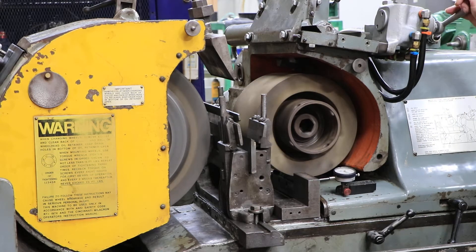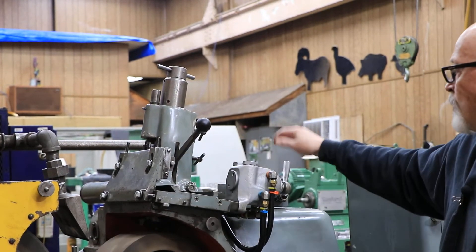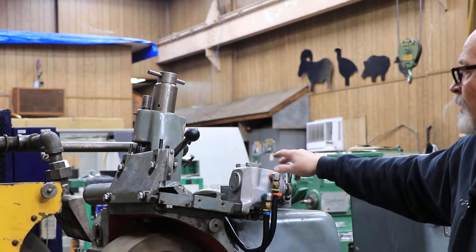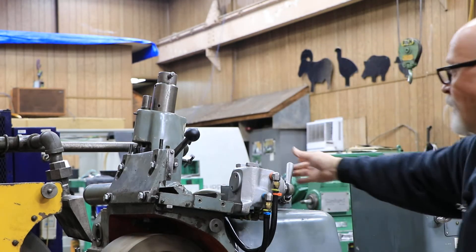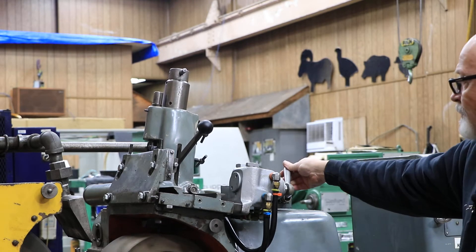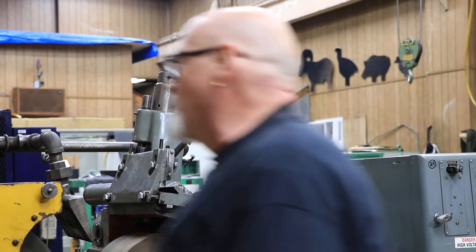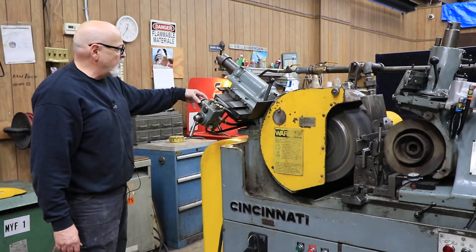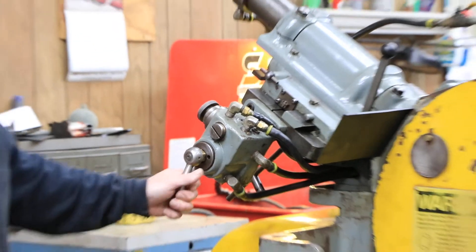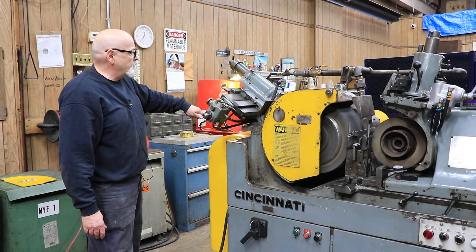You usually go faster for dressing and a slower speed for your actual grinding. You have your dressers here which you can adjust speed back and forth. It follows a cam here — if you wanted to use a cam, it has a follower. There's also a down feed with the diamond up here. We have a regulating valve right behind here — a knob that you would turn to slow down or increase the feed. Same here, you've got a rapid movement and a fine feed that you can adjust with your adjustment knob. Right now we're actually moving — this is the fast speed, this is the slow speed going back in for dressing, and then the rapid speed to put it back.